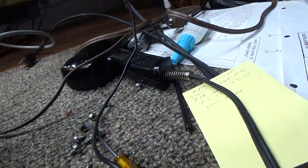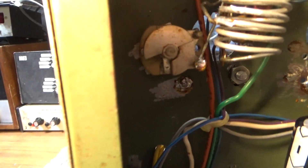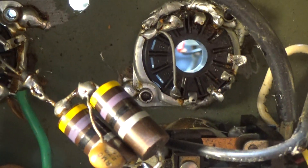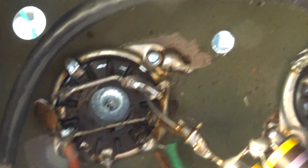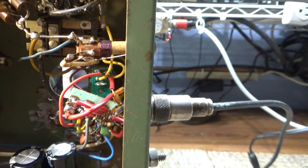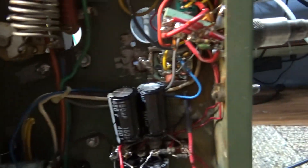Underneath you can see the bottom of that variable tune cap, the tank coil, and your load cap. That other socket only had the filament wire going to it, which I disconnected and wired directly to ground on the output tube. So it's also a single-tuber. It's set up for tetrode or modulation mode, has a variable input tuner, and they use that to set the dead key of this amp — similar to a black hat where they use the input to vary the dead key.